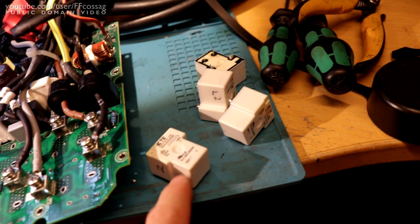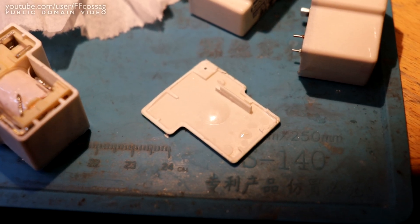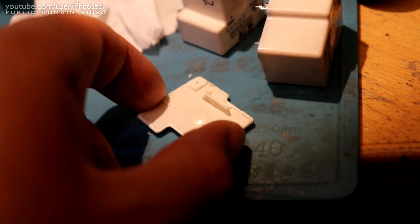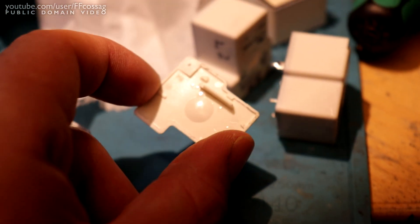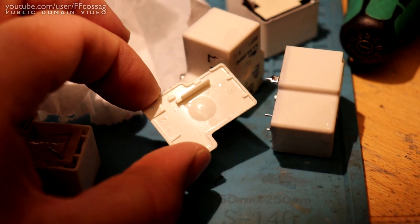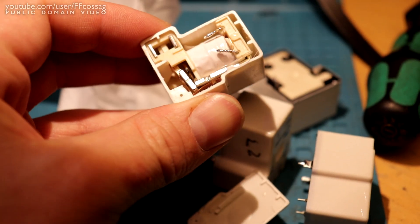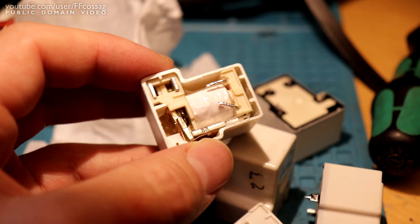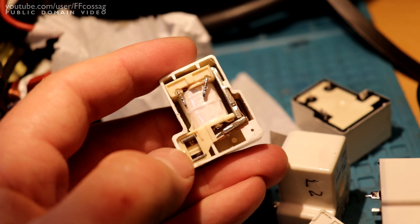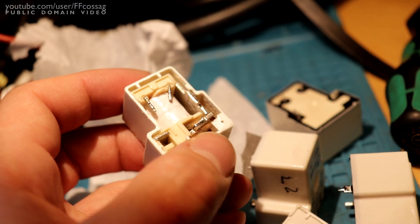Let's just slice the top out of these guys and see what's inside. There's the inside of the lid - there are tons of water droplets on that, tons of little bitty droplets. Actually, the inside of the relay doesn't look too bad. The contacts are slightly corroded, but it's really not terrible, and there's just a little bit of water on the walls.